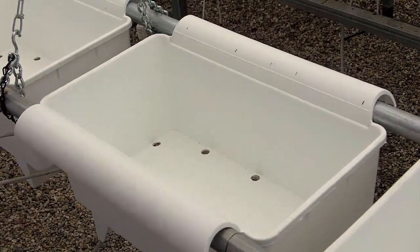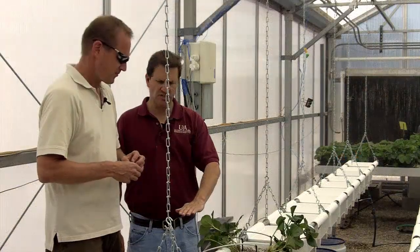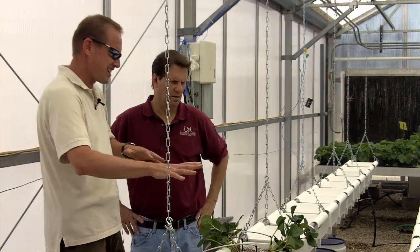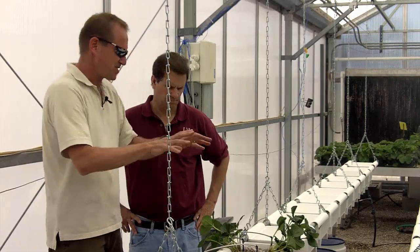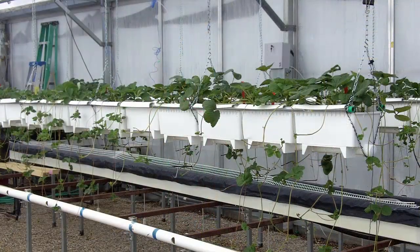This just sets, and you've got these little metal tubes — really just conduit, heavy conduit. I'm using three-quarter inch; you could probably get away with half inch, a little lighter, but still plenty strong to support. Now, you're about waist high here — I would assume a grower could bring that up higher. We're at this level because we were retrofitting a house that had other systems in it and had to match those up. But I would prefer it to be a little bit higher. Basically, chest high is about where you'd want to have it to work most easily on the crop.